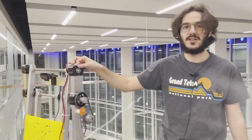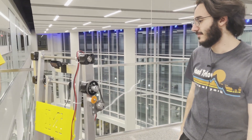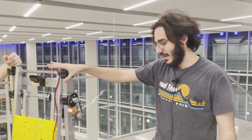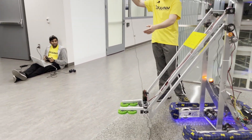This could be fixed by what we did up here with three bolts, shortening the chain so it doesn't skip, and making a more robust mounting method for the motor. To keep this metal from sliding and shifting, you could also use thicker stock. We ended up going with the thinner 2x1 stock because that was mostly what we had on hand, but definitely you should make something this structural out of thicker material. We did start this in CAD, and a lot of these measurements come from a basic sketch we did to see if we could reach far enough. When this is fully extended, it gets to the third level quite nicely.